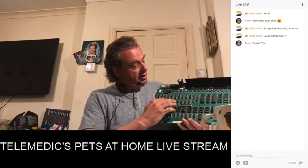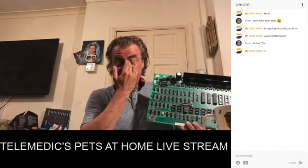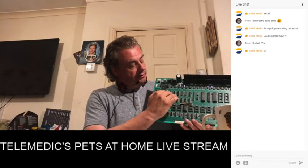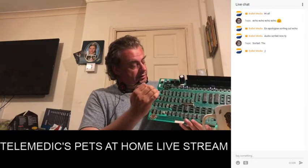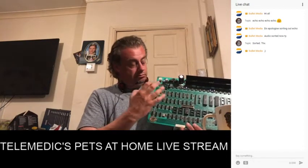Here are two more RAM chips. These are for the video. There are 4 here on this particular model because this is an 80 column set. So that's the video RAM. That's something else that I'm looking at changing to a larger size on one chip with more modern chips that will take less current.